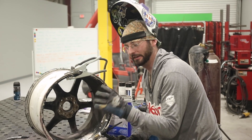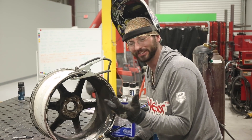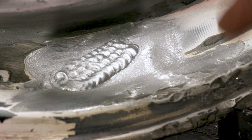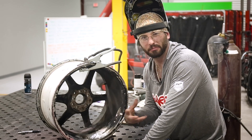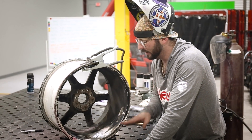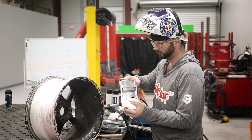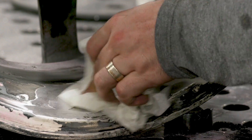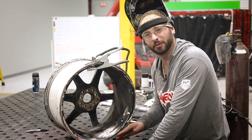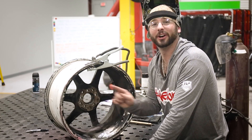Blue Demon Game Changers — barely felt that, just saw my hand on fire. Must have been acetone left on it. We've got the repair done on the back side — a couple of pad welds, and this welded a lot cleaner than the other side, maybe because there was a big hole there. Now we're going to take it the extra mile: sand it down more, clean it, brush both sides, then lay some pad welds all throughout this area — just in case those cracks were bigger than expected. If it's going to leak, it'll leak somewhere else, not here.